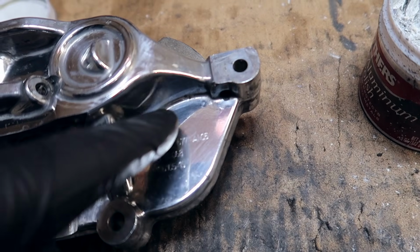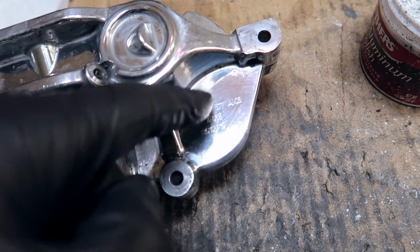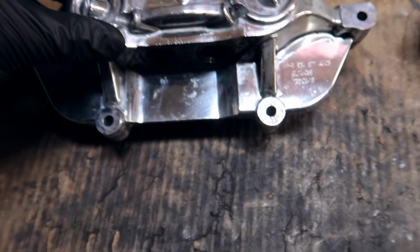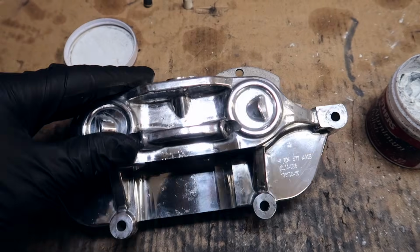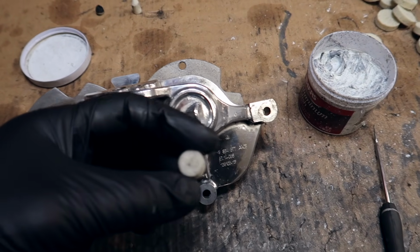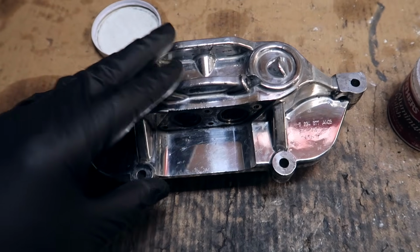Simply because once you get all those edges and corners out, it's much easier to get the dust out rather than these scratches that are going to be left on the outside, right? So those scratches we're just leaving for the very end. Once you're becoming really happy with your result and getting really close to where you want it to be, you just take this even lighter, you almost lift the Dremel off and just do a very light and thin coat of buff all around.